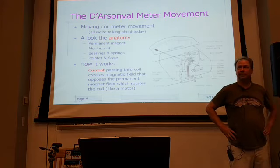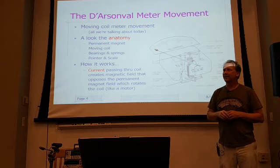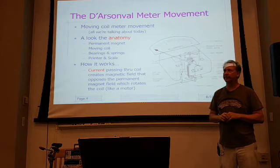You guys inspected the 2.5 volt on this 260? Here we go again with the moving scale. You'll notice that this meter is not linear. If you line up 1 volt versus the 250 volt DC, and the pointer's up on it, they don't line up, because the rectifier type actually has that behavior for the AC.